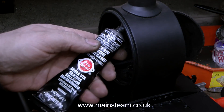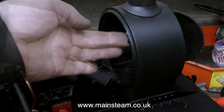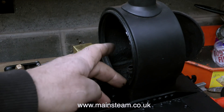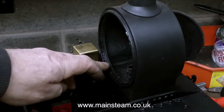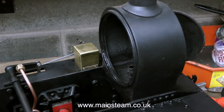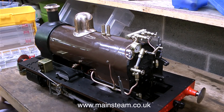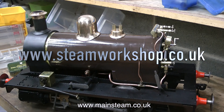It's time now to fit the boiler to the engine. A steam locomotive's blast pipe and blower only work properly providing there are no air leaks in the smoke box, and that's why smoke boxes always have a special arrangement to make sure the smoke box door is an airtight fit on the front of the smoke box. That's also why I'm applying some sealant to this end of the smoke box where the boiler fits, to make sure there are no leaks from here either. Before I can conclude the fitting of the boiler, I have to fit the ashpan in place because the boiler holds the ashpan in position on top of the axle box horns, and to stop the ashpan vibrating loose there's just one bolt that holds it in place. Now when I sit the engine on the bench, as you can see the boiler is fitted, and with the gun metal dome and safety valve fittings it looks good. To finish the job, I used a piece of brass boiler banding where the boiler wrapper meets the smoke box.